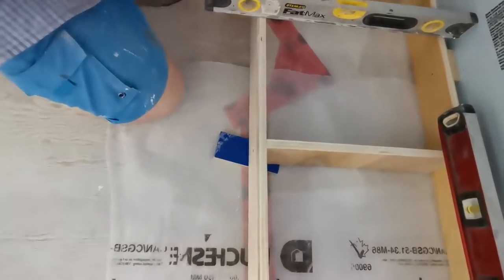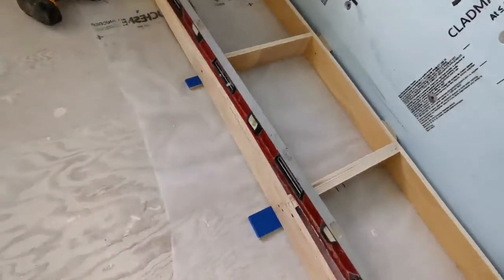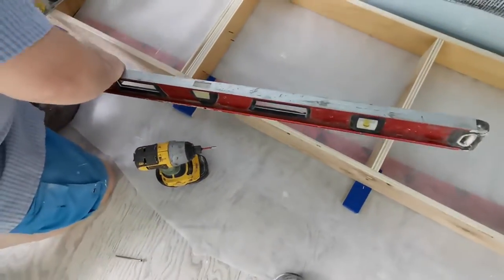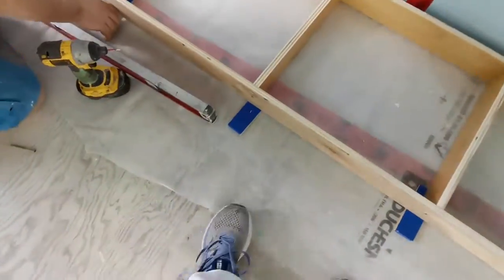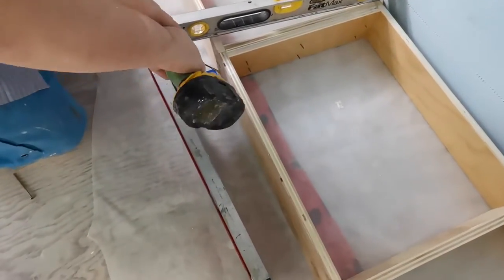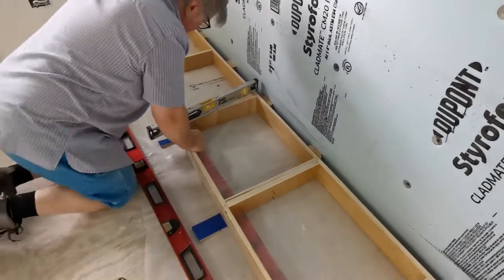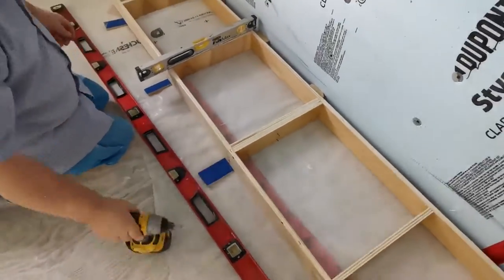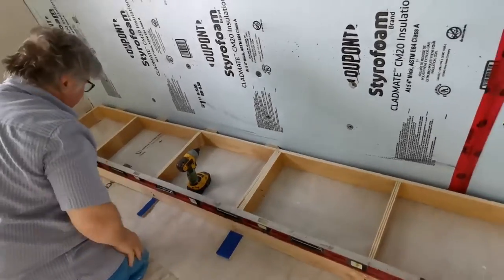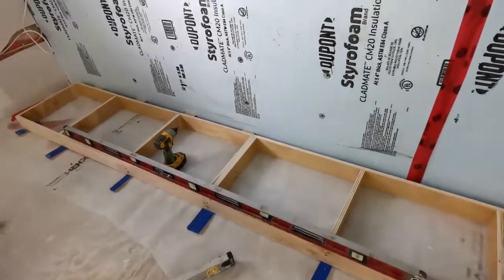You know, that's an option too, if you run into a problem or a place that's so crooked. I've done that before. I just put in cabinets to make it look straight to the room. But here, there's really no issue. The only headache is the left on the wall. It's out about 1/8 of an inch, and you'll see later, it comes up and I can only hide it so much, eh? That's a big thing with stuff like this. If rooms are crooked, all bets are off. There's just going to be different ways. And that's it.